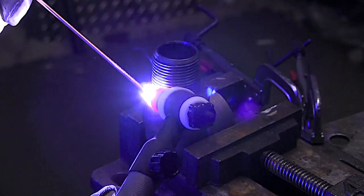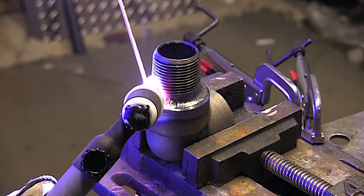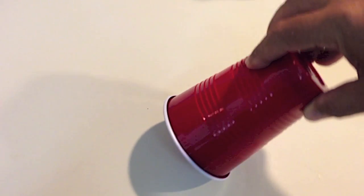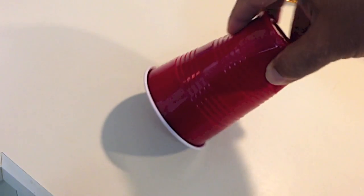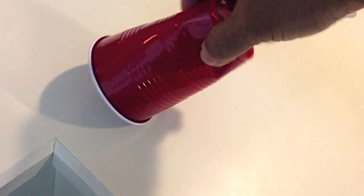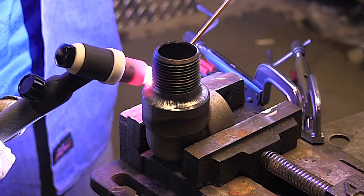The second pass is a little bit slower with a wider weave. Instead of a quick narrow wiggle, it's a much wider weave — much like walking a 55-gallon drum across the shop floor. The best way I can demonstrate that is with this red solo cup on a kitchen counter: just like rolling a barrel across the floor, you tilt it and roll it a little bit on the rim, back and forth. That's essentially what walking the cup is. First pass wiggles; second pass you're actually resting on the weld and then walking — a slight difference you may not notice if you don't pay attention.